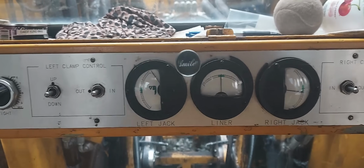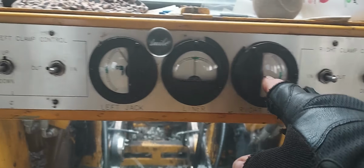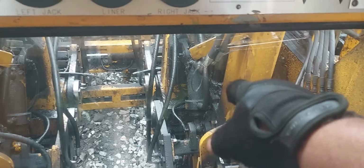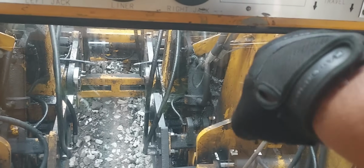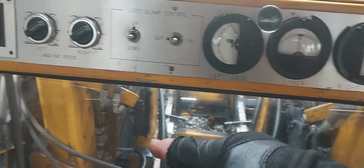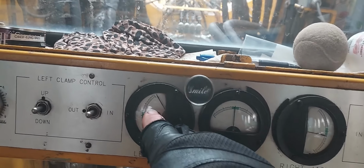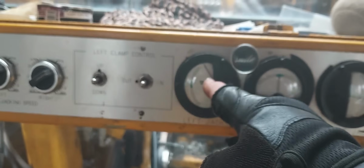Okay, I just tamped through it. It looks pretty good. Right here, we're great. This shows me the cross level, well, the relation of the rail over here on this side to that rail. This shows me the relation of that rail to this rail. So we're in really good shape here. Yeah, this rail over here is right where it should be.